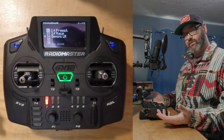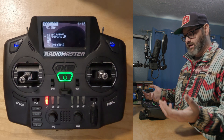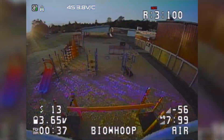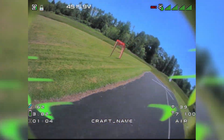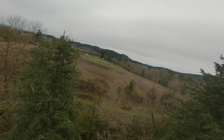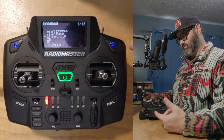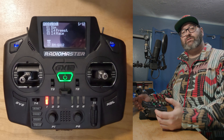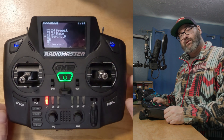You can make a profile for 900 MHz as well — I eventually might because I have a 900 LRS receiver I haven't used yet. Then you can go from flying your freestyle quad, to your race quad, to your long range build — all you have to do is change the model on your radio before flying each one. You don't have to go into the Lua script and change settings between each model like you would with model match, which is annoying. You only have to set it up once per type of quad you fly.